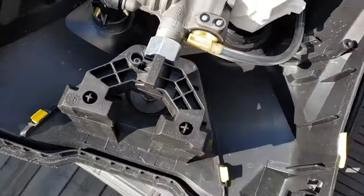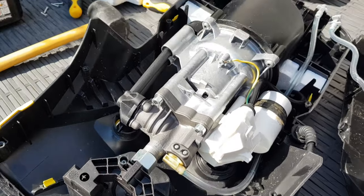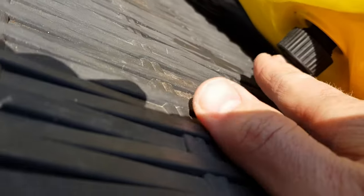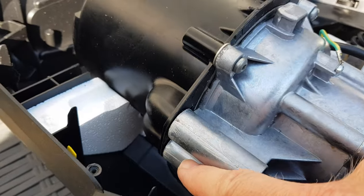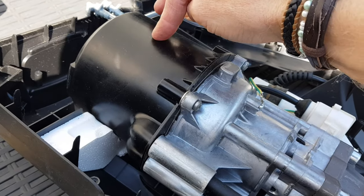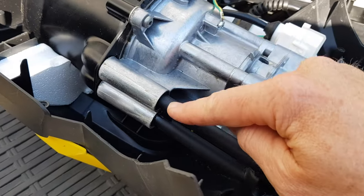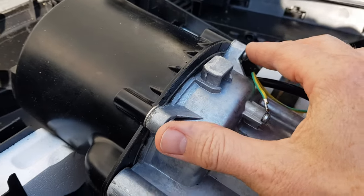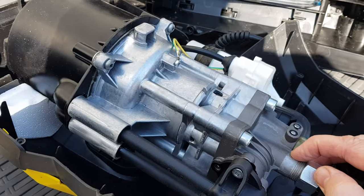Let's have a look at the inside. Following the water intake which is below here — water flows through this pipe up to this compartment, which is the electrical motor. Inside is the rotor that powers the whole unit, and the water flows here to cool this part down. It goes back and into the high pressure pump which is here. Do not open the top lid — that exposes the electrical components of the motor and you should not mess with that.